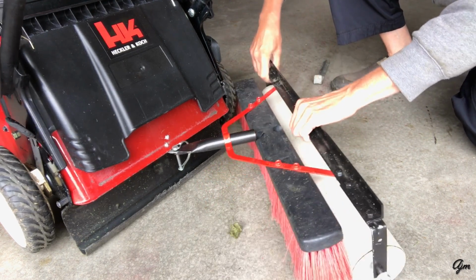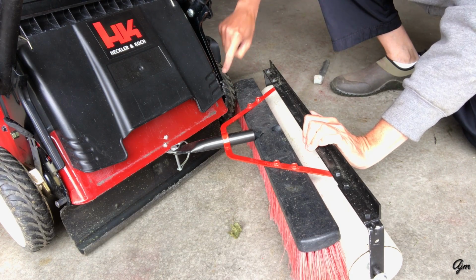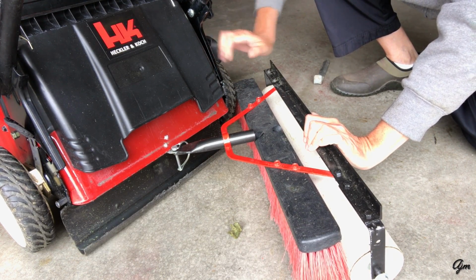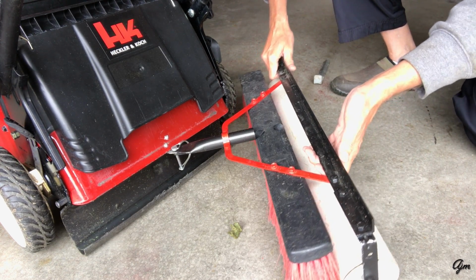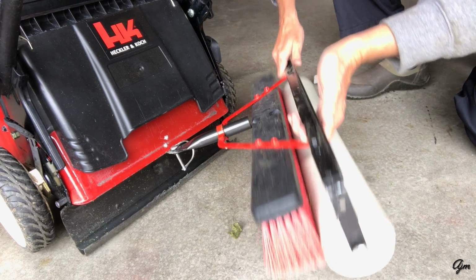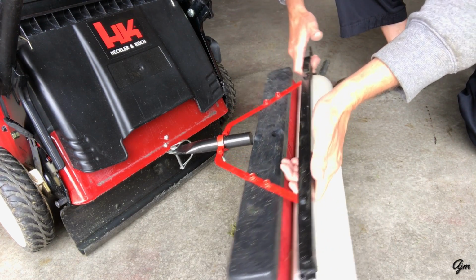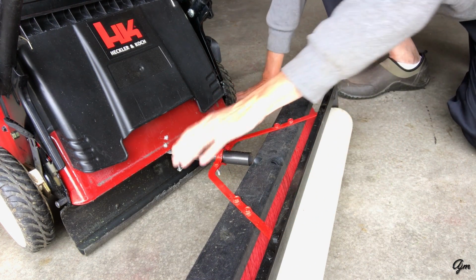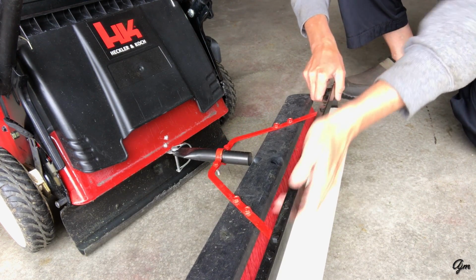And even when you jackknife it, the worst that can happen is that the plastic on the push broom hits your wheel. And that doesn't do any damage to the mower. It's not gonna do any damage to the striper. The striper, as you go over your lawn, it can wobble side to side. It can go up at angles. So if you've got a bumpy yard, it's not going to bend anything. It can freely roll over stuff.